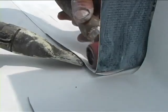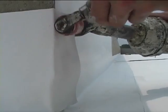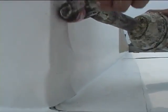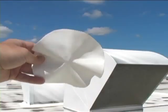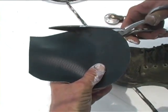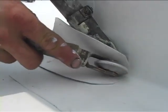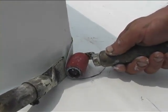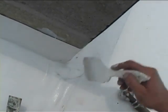For outside corner applications, the base sheet should be cut to fit around the corner. The base of the corner will need additional protection to effectively seal the corner. To accomplish this, cut a handmade patch or use a pre-formed outside corner. When not using a pre-formed patch, the edges must be rounded off to ensure a proper seal. Weld the patched or pre-formed corner to the base sheet utilizing proper seaming procedure. Coat the entire area with seaming adhesive to finish the application.